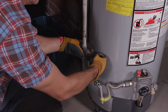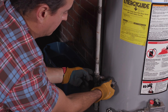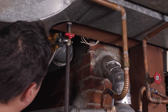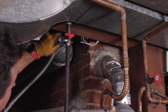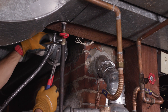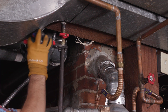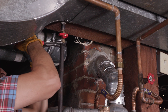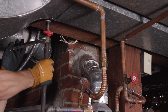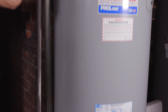We're taking off this little side branch so we can spin it next to the tank and remove this pipe — otherwise it would be banging against it. I'm going to see if we can get away with not using channel locks on this valve because it's already got some teeth marks on it. Addressing the gas duct safely is super important — we want to make sure we're safely capping off that gas line.